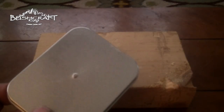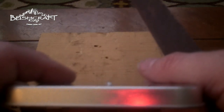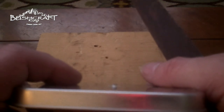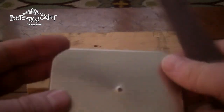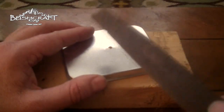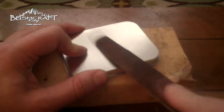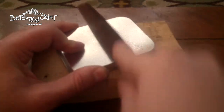One more step to this. Where I created the hole, as you can imagine, the metal folded out — you can see that there — punched out, so it's kind of sticking up. There's a little bit of a burr there where the hole was created. That's to be expected. So I'm going to take the flat side of my metal file and just go across that.